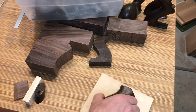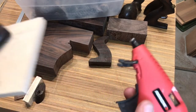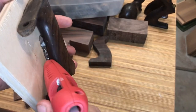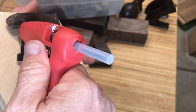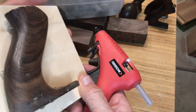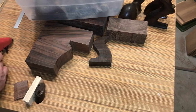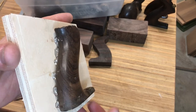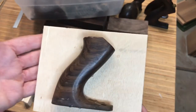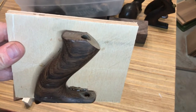All I'm trying to say is we need to know what we're going to cut and how. We put this on a little sled — I'm just using hot melt glue and we're going to fill it right up so that the part stays. Once it's cooled, we can snap it right back off its little mounting plate with no damage. I'm not screwing or clamping or squeezing. It's super easy to sticky this guy down and then take it right to the saw. So let's head to the saw.